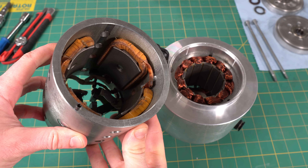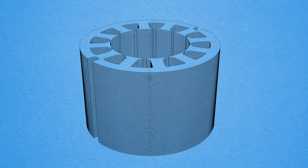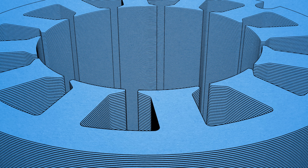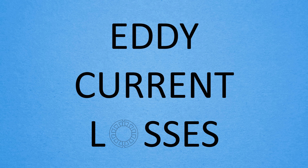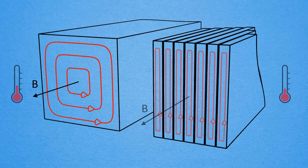So then I thought, what if I made my own stator? Well, this is where things get tricky. Stator cores are made from very thin electrical steel laminations, typically only fractions of a millimeter in thickness. The reason for these laminations is to reduce eddy current losses. A motor stator made from a solid core would indeed create a strong magnetic field, but it would suffer from several significant drawbacks compared to one made from laminations.